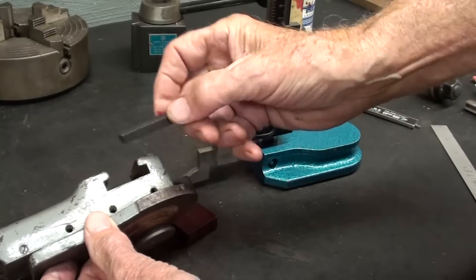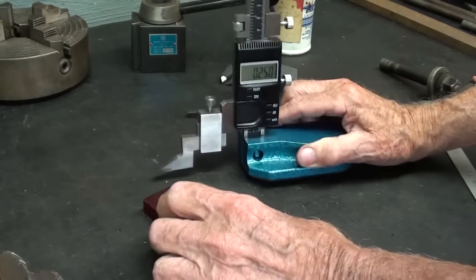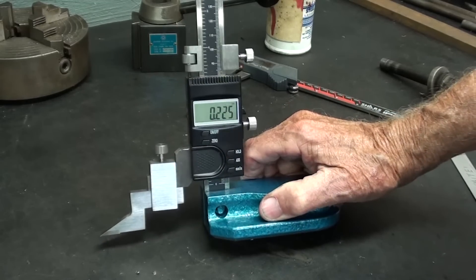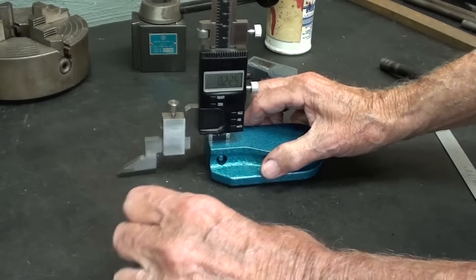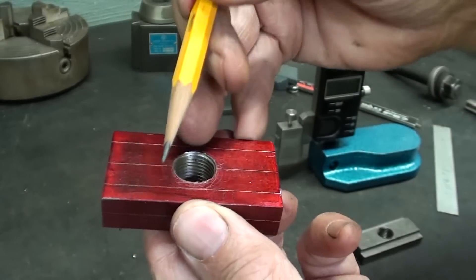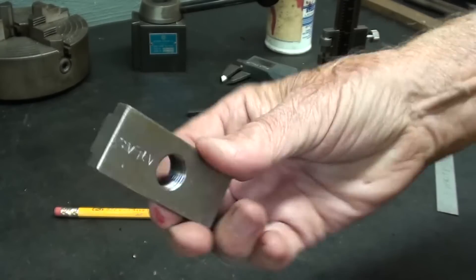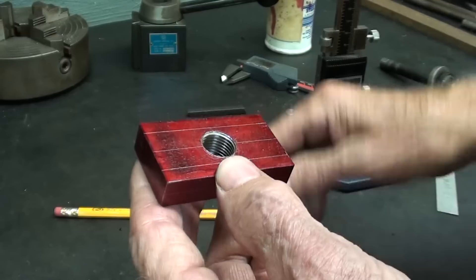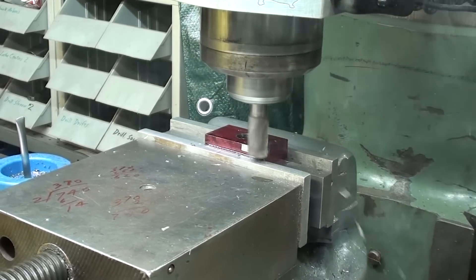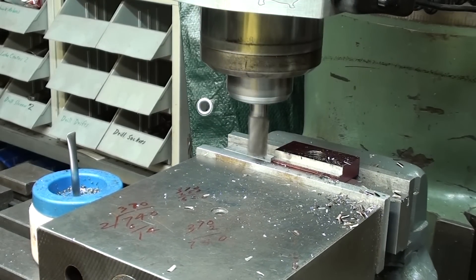This is a one-quarter inch tool bit and it fits just nicely in there with just a little bit of play. I have the height gauge set for 0.250 and now the height gauge set for 0.225. This is what I'm going to mill out right here — you can see what it'll look like from the ends — so that I end up with essentially a T-nut, only in a slightly different dimension. Let's go back to the Bridgeport and do the same thing to the other side.